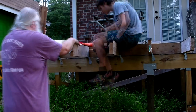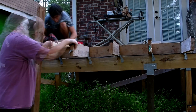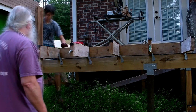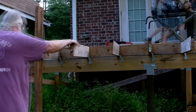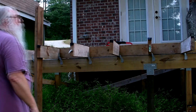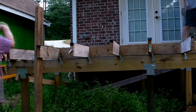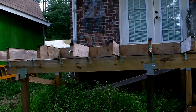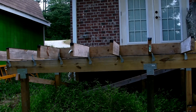You can see here it's got a bad twist — I just put the board there and use it to give some leverage to pull the twist. Once we get it screwed in and get it down into place, I probably should have put another board in there. I'll probably go back and do that later and add another board. Everything is actually perfectly fine — it's exactly as it is. But I did forget to put a block there on the next one over, so I do need to get out there and put another block there. We did get those twists out quite a bit there.